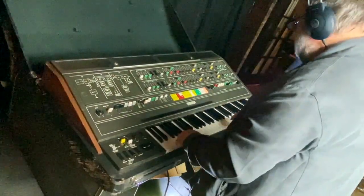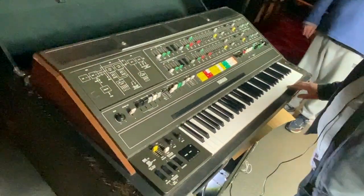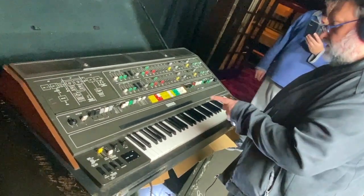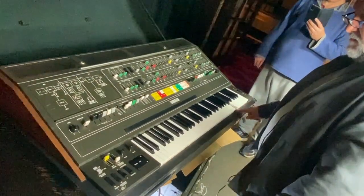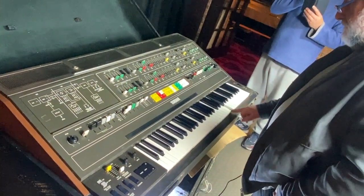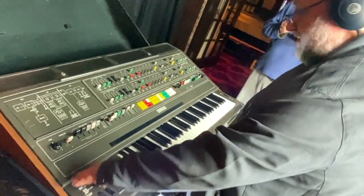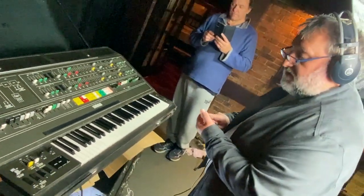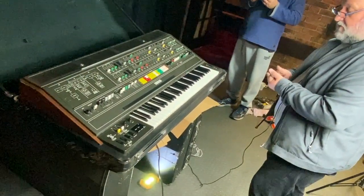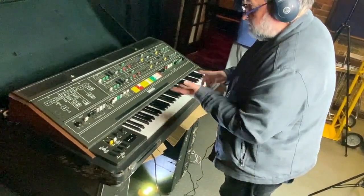De-tune works, that's fine. That doesn't sound good. So we've got droop on the CVs, which wouldn't surprise me. If you have long sustains, you can hear the control voltages for the oscillators drooping. That's on keyboard one — so listen to keyboard two. That's much better. So essentially the sample and holds for the keyboard on keyboard mode one have a lot of droop — that would be moisture ingress into the PCB hold capacitors, the op amp, or something else. Definitely sortable, definitely not right, but not too bad.